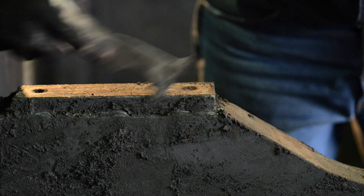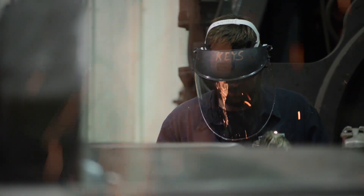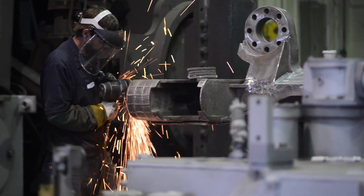We would capture all the waste material that comes off. We clean everything down to the base material. We'll sandblast the frame so that we can get a good look, do die penetrant checks and inspections to determine the extent of the repairs.